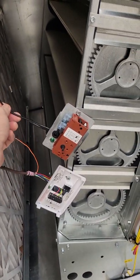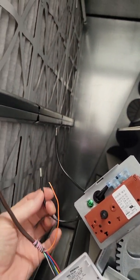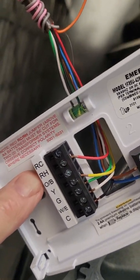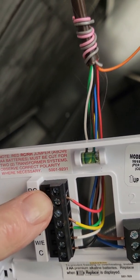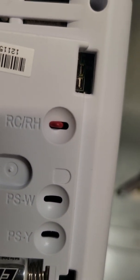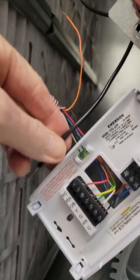Here we are with the two devices mounted. We've got two wires here — one of them is going to wire-nut to this orange wire and go back to the reheat contact, and the other one is going to land right here. With this White Rogers thermostat, there's an RC and RH contact, and there's an internal jumper — you're supposed to cut it if you don't want it, but we do want it, so this is convenient. That terminal is going to be powered when I put the thermostat on, so I'll just land this wire right on there.